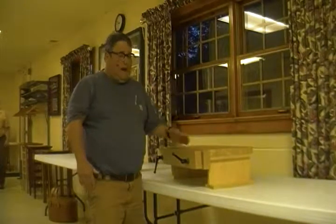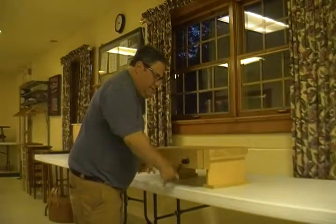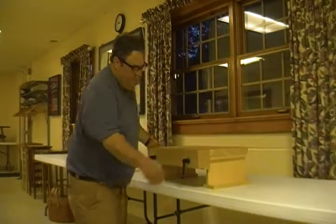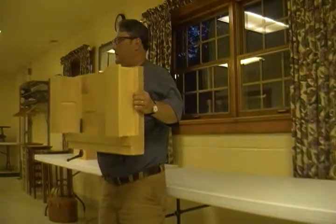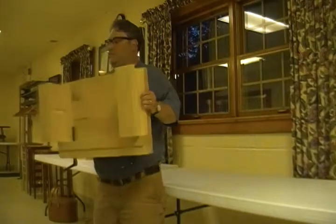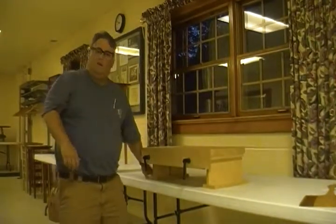One of the things I like about it is for larger pieces, so the way it attaches to my bench, or any bench, you can basically just clamp the legs on this, which are basically tees of plywood that are dadoed and glued up with a top rail and a bottom piece, and they extend out a little bit wider on the ends than the top.